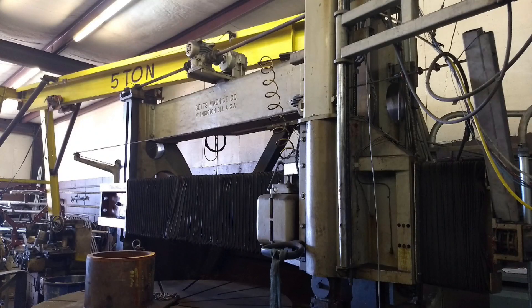I'm going to go handheld because I want to show you the drive setup, including power in and the way I have everything. It's always a great idea — in fact, I say it's mandatory — that you bench test everything. Motors on the bench. Never do any of this configuration with motors coupled to a machine. This machine was quite large, a very large vertical lathe. So anyway, you do all this stuff on the bench. Oak is on the bench, the drives are on the bench, and the motors are over here.